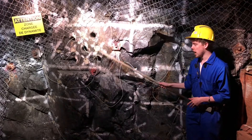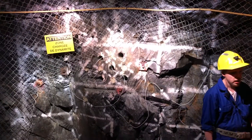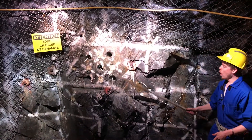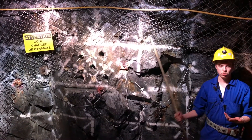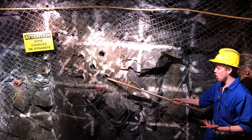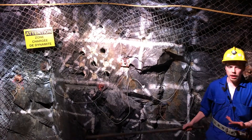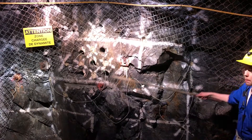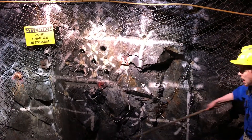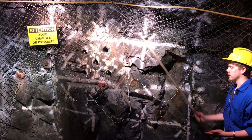Once they're all hooked up, all these charges will eventually go off. When the blast goes off, we don't drill the cut — the rock is going to want to come out this way and we won't get a nice clean blast all the way through. So we make sure we drill all the way through to the end of the holes. The reason we only drill the cut once over here is because once this area has been blasted out, you have a nice big empty space for all the rock over here and down here to go into — so there's no need to waste time drilling that out.